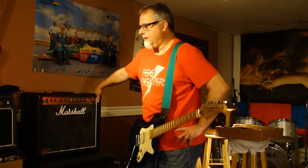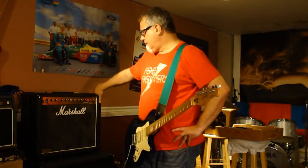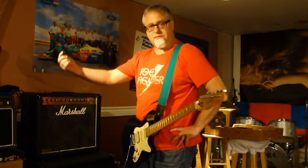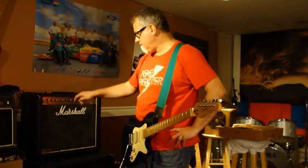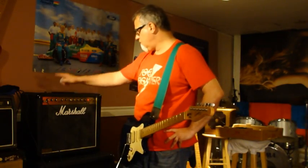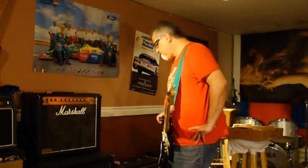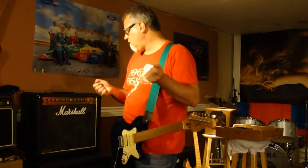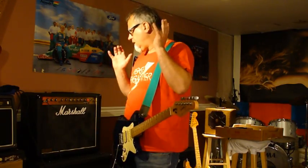After painstakingly rolling a whole bunch of tubes through the preamp section, I learned a funny thing about this amp, and that is the V1, the first valve position in the back of the chassis all the way to the left, actually is the boost channel. So it's like 1, 1, 2, and then mix is the third tube, which is kind of screwy when you look at the schematic. But it proved itself out because I had a tube that was basically half junk and made almost no push at all. And I put that one in and identified it with the foot switch. Whoa!